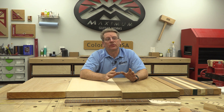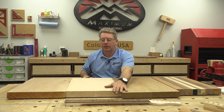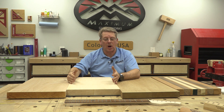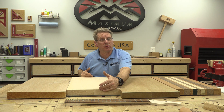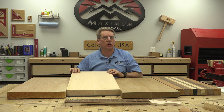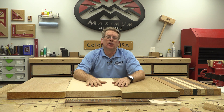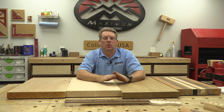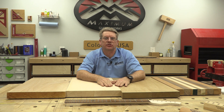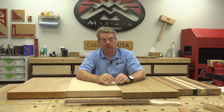There are a couple of different ways you can source it. You can buy a body blank that is already glued up to approximate dimensions of maybe 13.5 to 14 inches wide and 20 to 22 inches long, and generally about 1 and 15/16 total thickness. You can certainly do that to start. But you can also go to your local hardwood supplier — not a home improvement store, they won't have what you're looking for. In my town we've got several hardwood supply places.